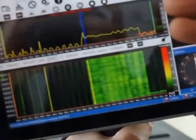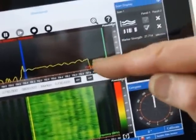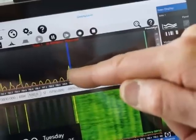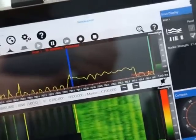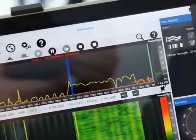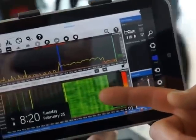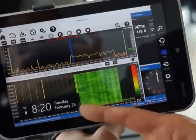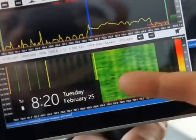What I have here on the screen is spectrum analysis, and what I'm actually zooming in on here is a cellular signal on the right, but on the left hand side you see an interferer that pops up every now and then. We have a waterfall diagram here on the bottom which allows you to look at when you have an intermittent signal rising to a higher level, indicated by a color change.